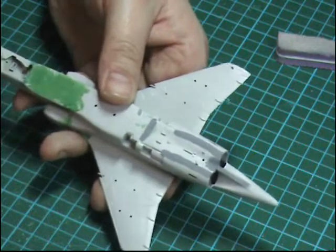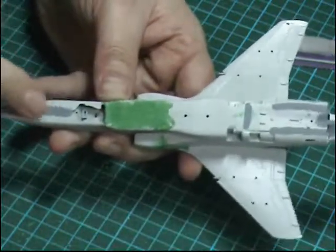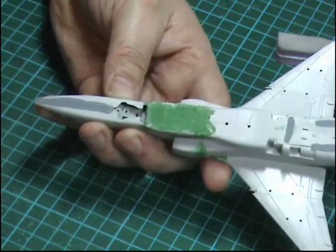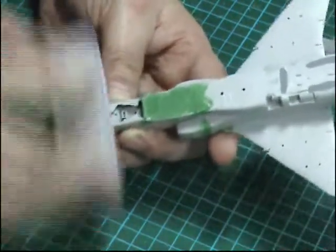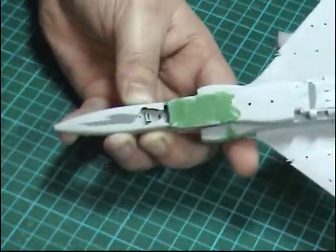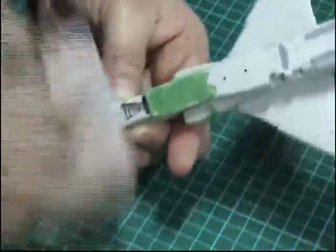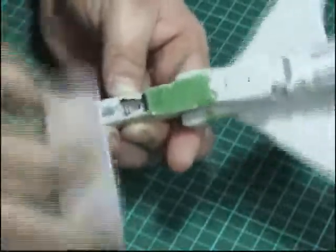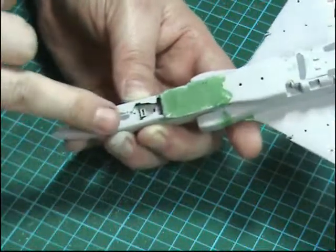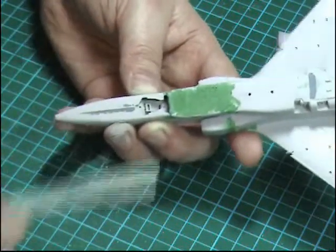Now obviously I've still got this area here, we've still got this one up here. So what we're going to do, I've deliberately not very well sanded this area down here. So if I show you what I mean, all you do, come along with your coarse type sanding sponge and you give a rub. And as you can see a line appearing. So if I just carry on. Just like that, and you can see this line running down the side, and that is because there's a step there. So that needs to be sort of refilled and retaken care of, or filed down.